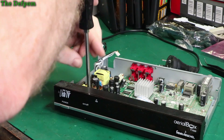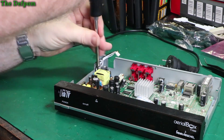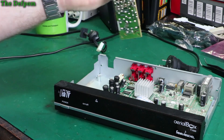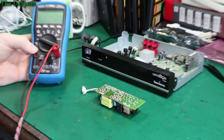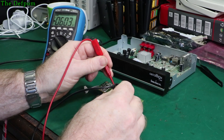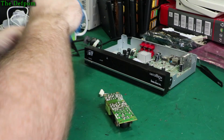When working on these kinds of gear and working on power supplies, always be mindful that there could very well be high voltages still present on the capacitors. I'm comfortable working on this kind of thing, but if you're not familiar with it you could easily injure yourself, or potentially kill yourself, by getting a zap off one of these things. So I need to make sure these capacitors are discharged. I'll put that as a disclaimer. Voltage on this capacitor - got 0.6 volts, that's fine. That one's dead. Nothing on that one either. We're safe, I'm not going to get a zap off it.